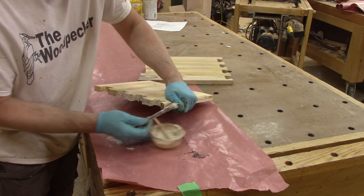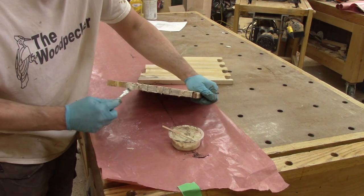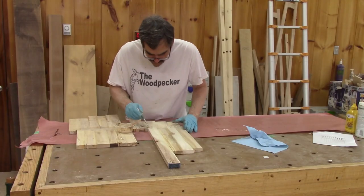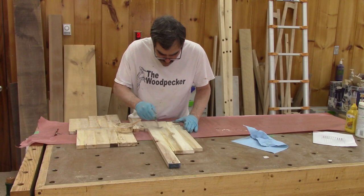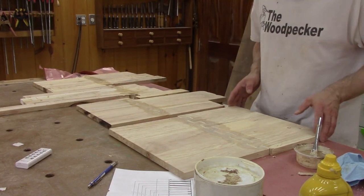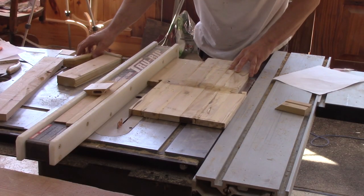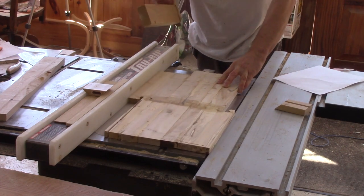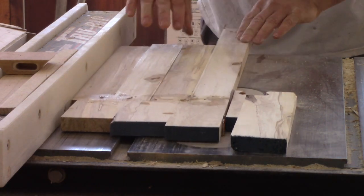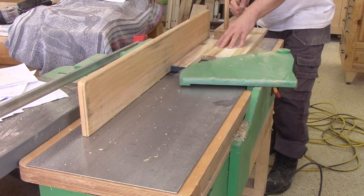To do so, I use glue that I've thickened a bit — it looks more like paste than glue. I spread this on each puzzle shape's end and clip two panels together. Then I add a bit of glue on top to fill the small gaps. I do this for all my panels and wait for the glue to dry. When it is, it's time to cut all those panels straight and parallel. Then I resurface the panels.